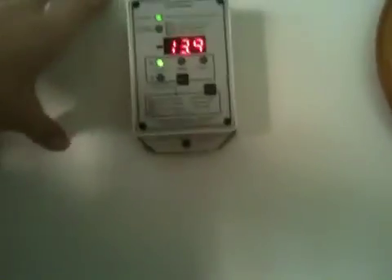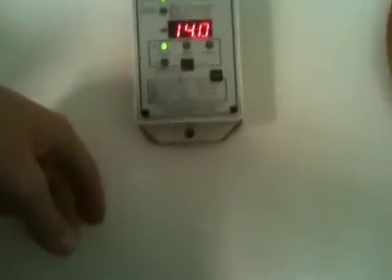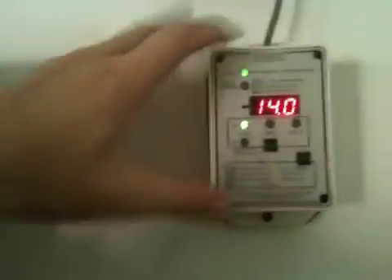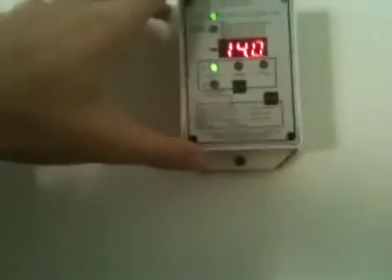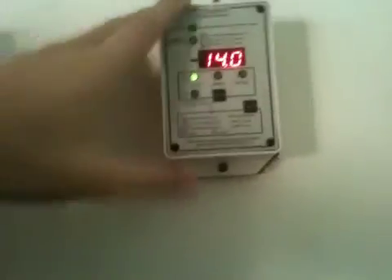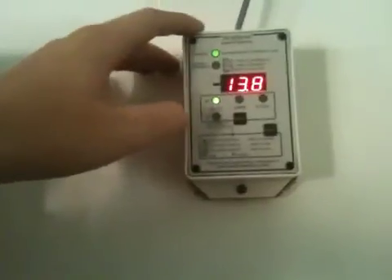You have to have a way to monitor how much power is in your battery bank. Knowing your percentage is key to any system regardless of how big it is. You need to get this meter or some other meter that monitors how much power is actually in your battery bank. If you have an Outback inverter and controller, you can get the Outback DC monitoring system that hooks up to the Mate — it does the same thing as this but it's all one component, a bit more expensive, and looks really nice.